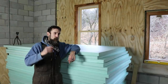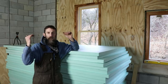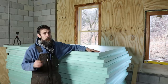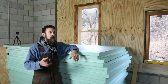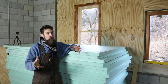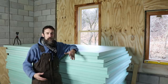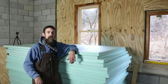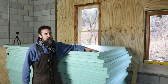Let's quickly go over why I chose foam board over more commonly used materials like drywall or plywood. For shops, I've seen literally everything used as a ceiling material — we just want a barrier between our workspace and the attic to hold the heat in. The reason I chose this is price and what you get for your money. I get a barrier and an R-value of 10 in a two-inch thick piece, which is pretty good. With plywood I'd just get the barrier, and current plywood prices made it unrealistic to sheet the whole roof and then add expensive insulation on top.